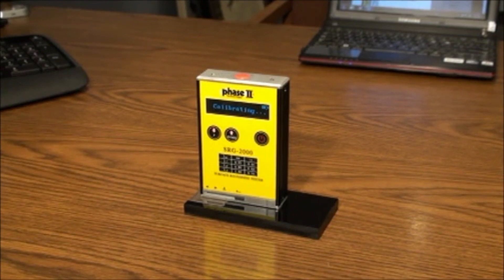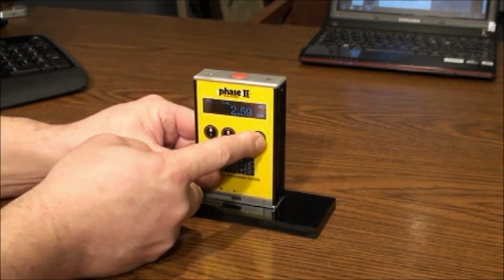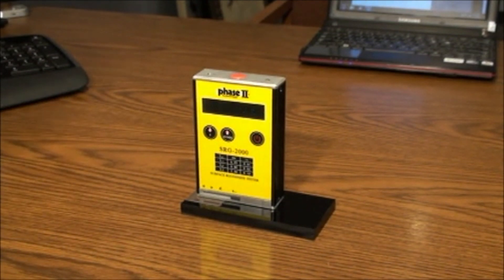The value displayed at the end of this process should fall within the allowable tolerance of your test sample. You'll notice "calibrating" is showing on the screen. To complete the process, power the unit off — this will save the new calibration. Normal measurements can resume at this time.